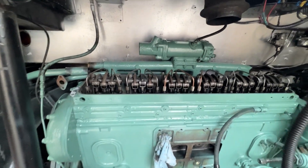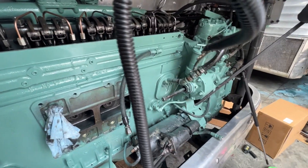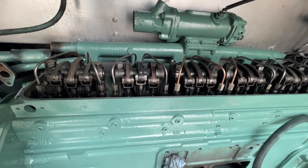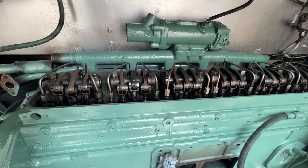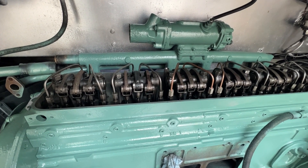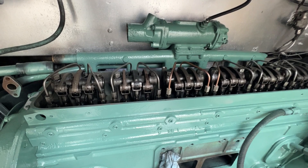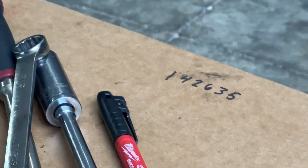We're getting ready to do the tune-up on the top end — setting the valve clearances and then fuel injector timing. We're barring the engine over. This is a two-valve head, so these are exhaust valves. We set them with a .013. You get a smooth pull on that, tighten the nut down, and then the .013 should no longer fit but a .011 will fit. The firing order for this left-hand engine is 1-4-2-6-3-5, left-hand rotation, 671.